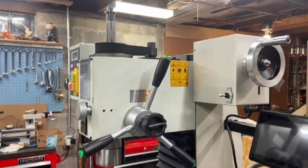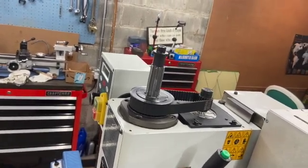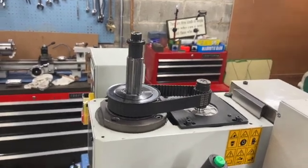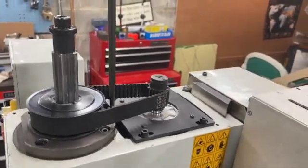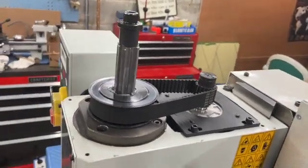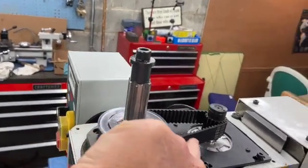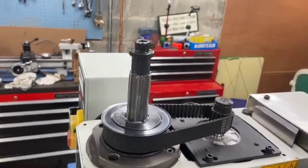What you have on top is simply a pulley running with a belt to the motor in the back. It's a simple arrangement: you loosen four screws — the motor plate is slotted — and those are a four millimeter Allen. Then you take something like a screwdriver and snug it up. You don't want it real tight, but when I found it, it was quite loose. Get it so there's just a little bit of deflection when you press on it. You don't want it too tight because that'll damage the bearings.